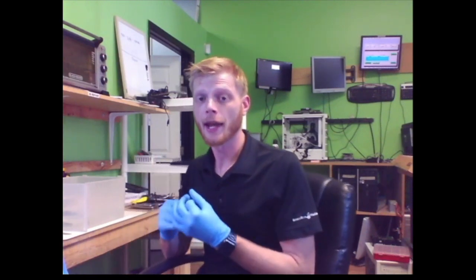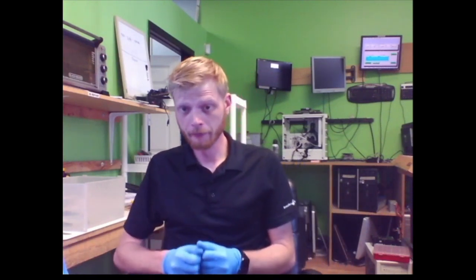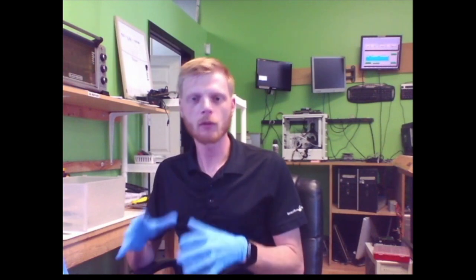You should immediately open the device, disconnect the battery, and I like to take the board out immediately and throw it in ISO. I don't like to do the ultrasonic right away. I don't like to start scrubbing with the ISO right away because I want to do a visual inspection first. The reason that's important is because if you go right to the ultrasonic and then right to the scrubbing, you're going to wash away evidence, okay? If you're in a situation of data recovery, which most liquid damage is, you're wiping away the evidence of what could be damaged. So that's the important thing.